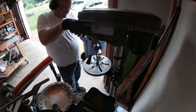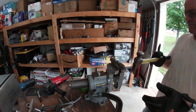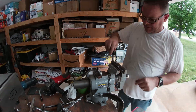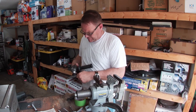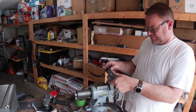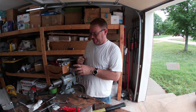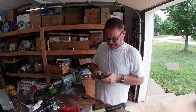Then I drilled out the outer holes for the half inch tap. Once complete I tapped the holes by hand - this was actually easier than I expected. After that I went ahead and assembled the bars and tried to put the two middle bolts in. Unfortunately, having drilled each bar separately, the holes were close but they did need a little persuasion. Reminds me of an old four-wheeling phrase: don't worry, it'll fit.